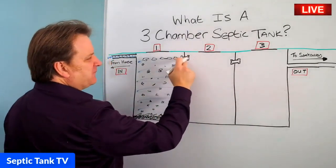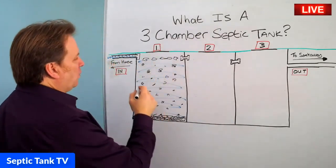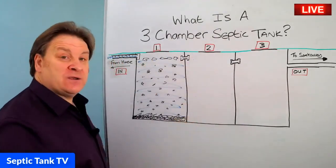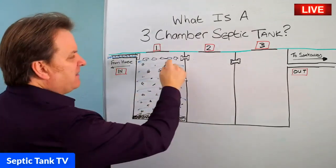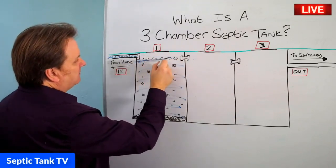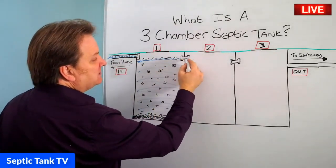You're probably wondering what these funny things are here — they're called T-pieces. What they do is they let in all the debris and all the suspended solids, and they stop it going on any further. So the wastewater will fill up in the first chamber with all the debris and stuff. When it reaches a certain level, the tide mark stays constant there. So when you put more water in, it pours into the first chamber and then overflows into the second chamber.